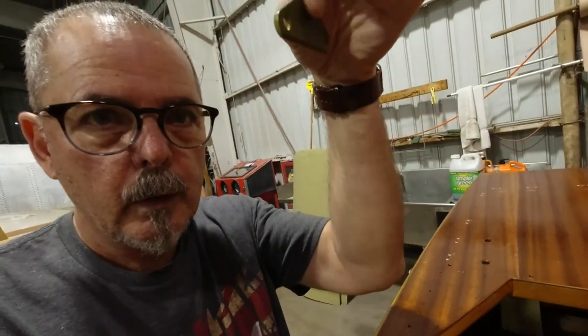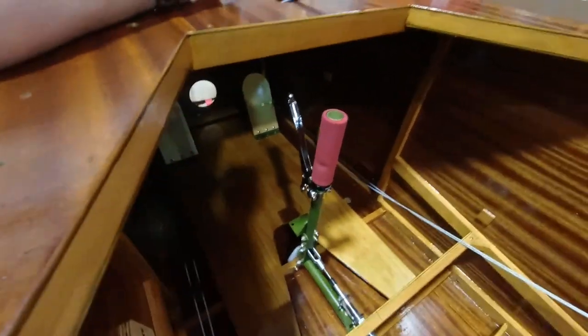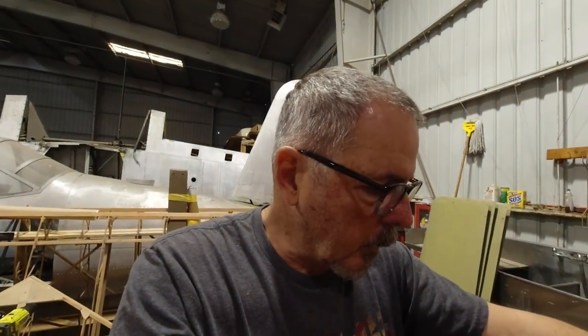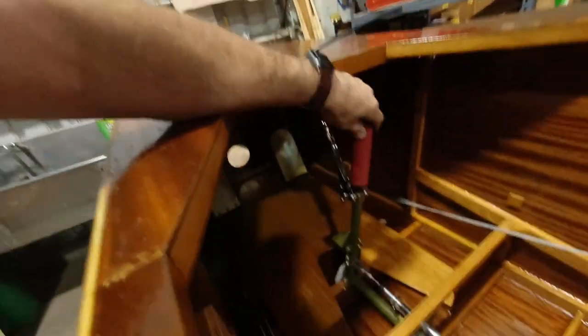And so it pulls on this when you squeeze the handle, and it's really just to hold you in place. Those band brakes are not designed for heavy braking. For a plane of this speed, that's really not necessary anyway. If you have a need for heavy braking, you probably should have gone around. You can put this thing down and get it stopped in 200-300 feet, especially on grass, maybe not on asphalt. You might need a little more runout room, but this is all set now. You saw I got the safety piece in there, and that's all good to go.